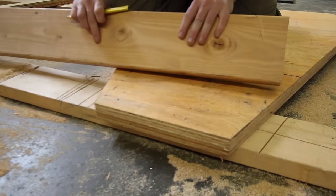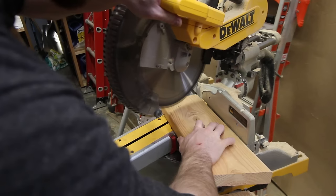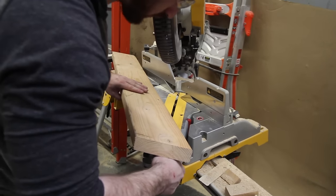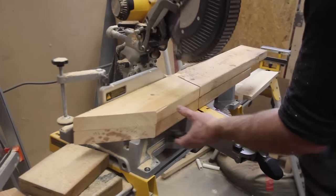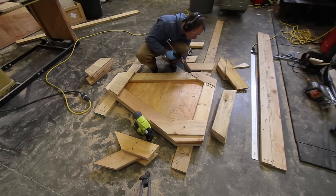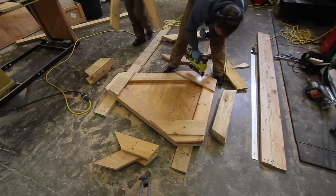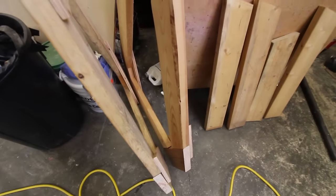Since the sides are a weird shape, we are using a truss framing method where we have four internal shapes that look the same as the sides, and those provide the framing pieces for the whole setup. Instead of having a wall with a top plate and a bottom plate, we have four trusses that are connected by blocking pieces.